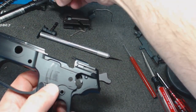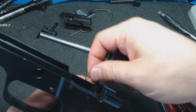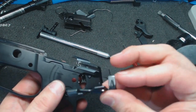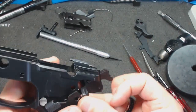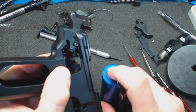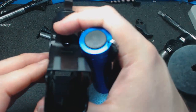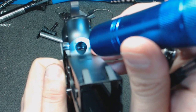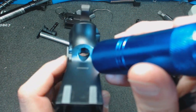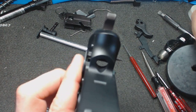And when we were talking about the hammer drop mechanism and its wonky spring, what's going on there is just this whole mechanism reaches way in there and gets right underneath. Let's see if we're going to get any angle where we can see this. Right underneath the edge of the sear. So if you look at it from this side, hoping you can see in the hole, as this comes in from the side, it just barely meets the edge of the sear, or the underside of the sear. So now you can see that come just right there. So it's basically on the underside of the sear.